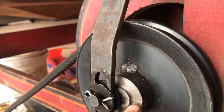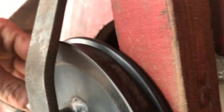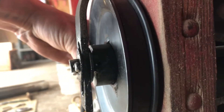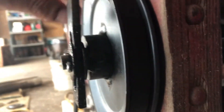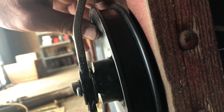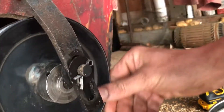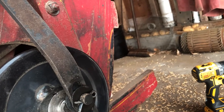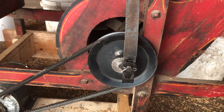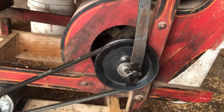This is what we came up with - you can see I took my weld hub and I faced the whole thing off. I made a recess so that you've got that weld fillet, just to give it a little space so you get some penetration down the bore. It's just a roll pin - that simple. It's a weld-on hub. There's just a piece of half-inch round; I drilled a hole through the side, welded them in, and timed them with the keyway.